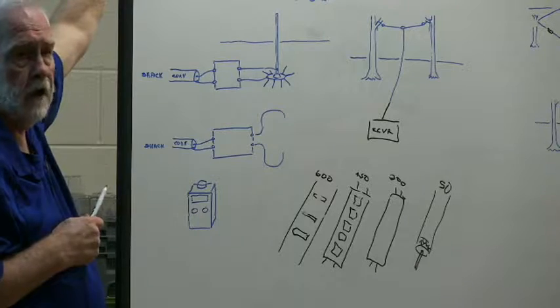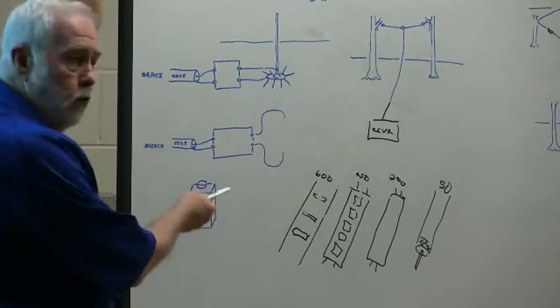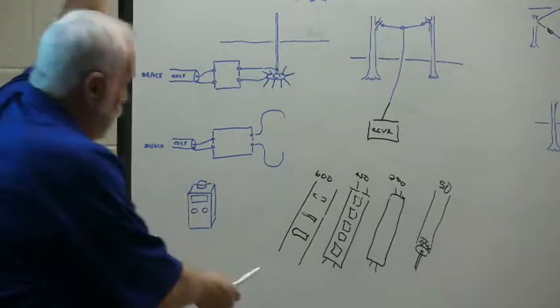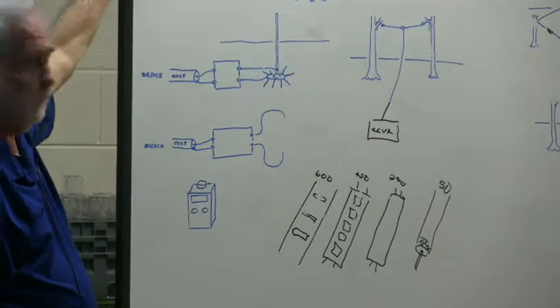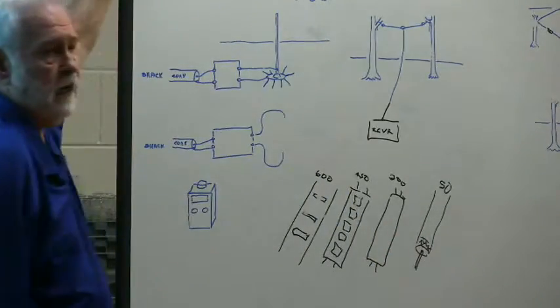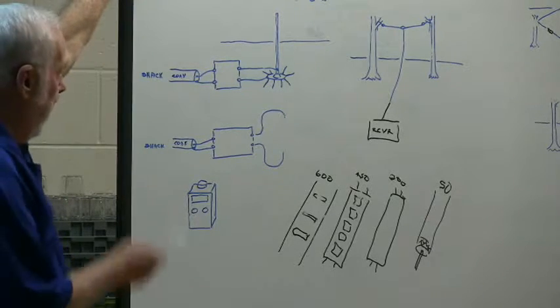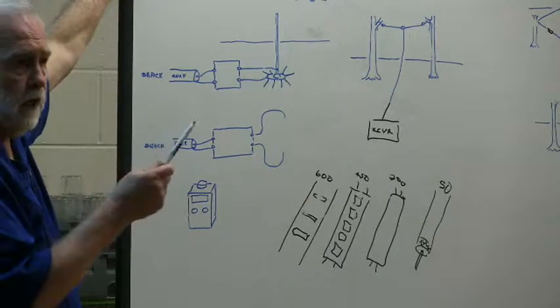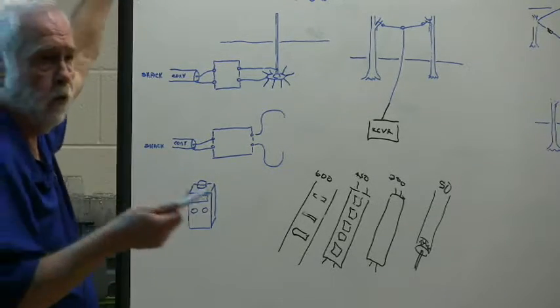His answer was, it's not that kind of an ohm. Simply accept it for what it is. You put two wires 6 inches apart, it's 600 ohms. You get some coax stamped 50 on it, accept it. It is what it is. Don't try to understand it. Actually, there are three things that make it what it is. I can show you, but 90% of you would walk out of the room.